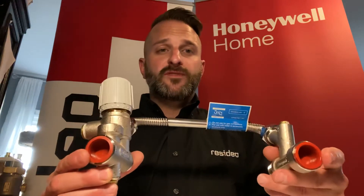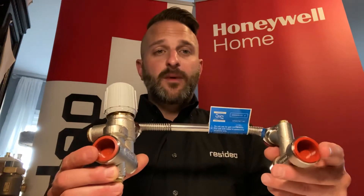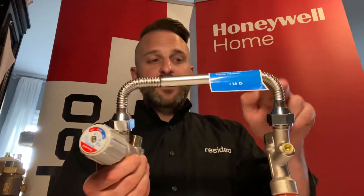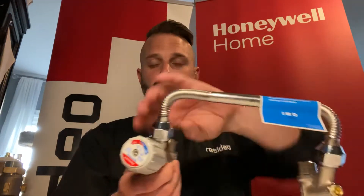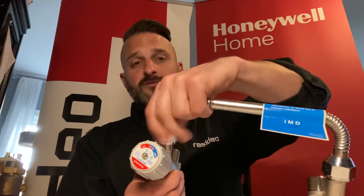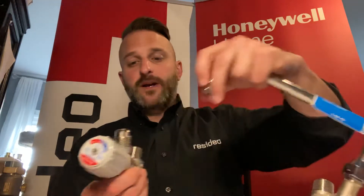Simplified installation — you already have three-quarter inch female NPT threads on the bottom, so the threads right on top of the tank. It comes with the bypass, and these are flared fittings, pre-flared from the manufacturer, so you don't have to use any pipe dope or break out your flaring kit. This is a push style, so when you set your output mix temperature, you push it in and then make your adjustment.